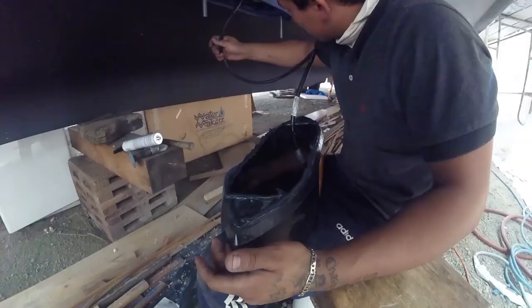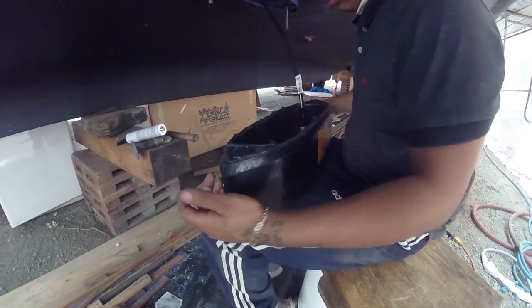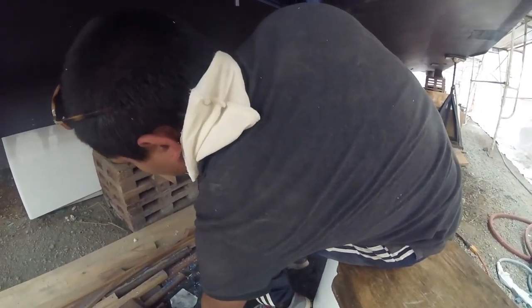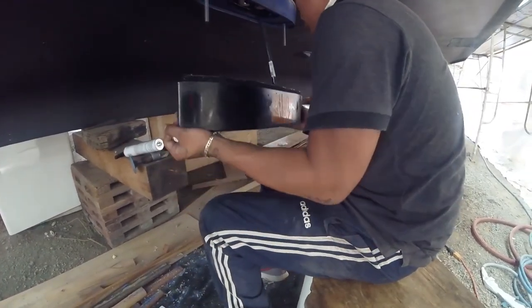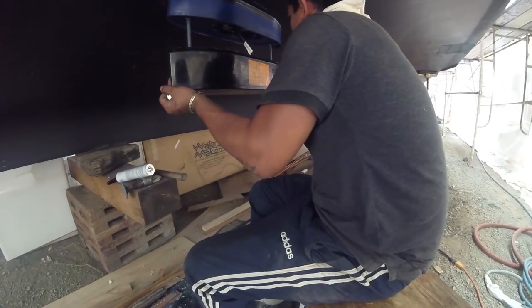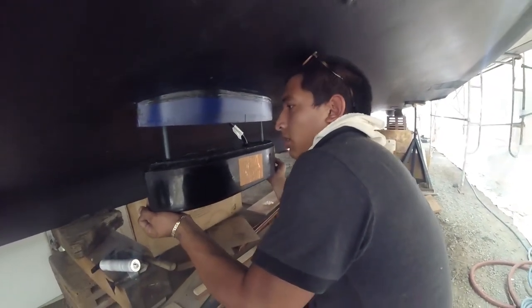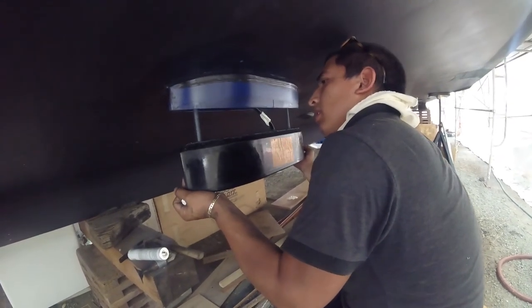Okay, so we'll pull all this cable up now. We have the rods measured out, so that should be adequate. Just get one washer on there first and one nut, and then we'll put the sealant on the other side and then come back to the other one. The cable goes towards the back, but there's a little silver tab on the bottom, which is a temperature sensor that has to go towards the rear.